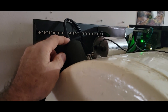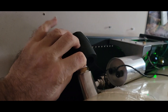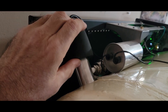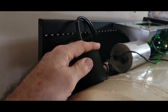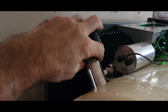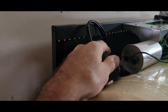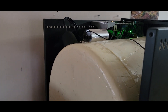While we have the back off, this is where you can get an epoxy leak sometimes, right up in here. I went through the test — spray carburetor cleaner on it while it's under vacuum. If the vacuum pressure increases, there's a problem with the silicone seal, and then you'd put tape around the area to make a dam and fill it with epoxy. But that wasn't the problem, so I didn't have to worry about that. There's a leak somewhere else, so we'll continue with some other tests. I contacted Harvest-Right and they gave me a couple other things to try.